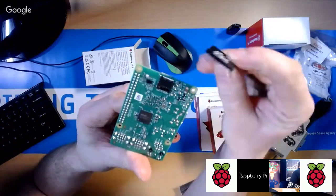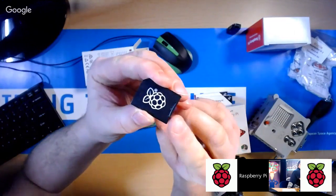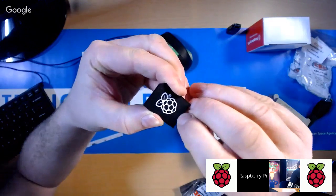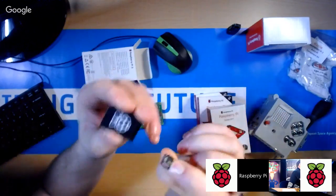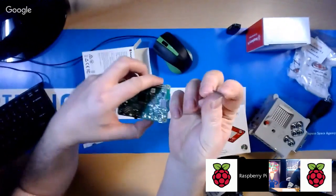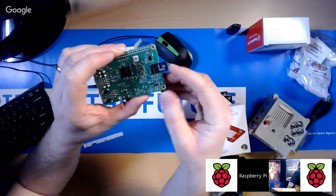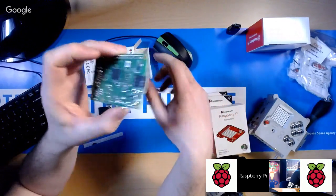And you can obviously see that that's way too big for it. But if you look closely, you see down at this bottom, there's a little tab there. And if you do that, that comes out. Okay, so this is only for if you wanted to put this into a PC or some other computer to access it. But essentially, just take this out, pop it in here like this. Okay, and that's basically the boot drive that it's going to boot from.